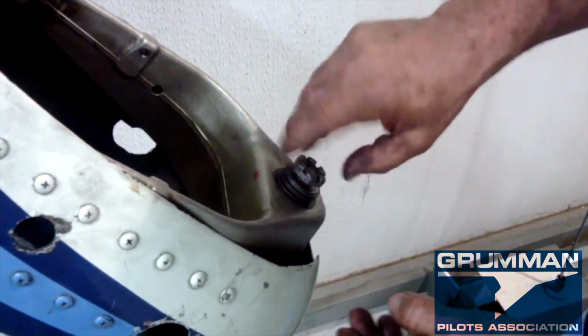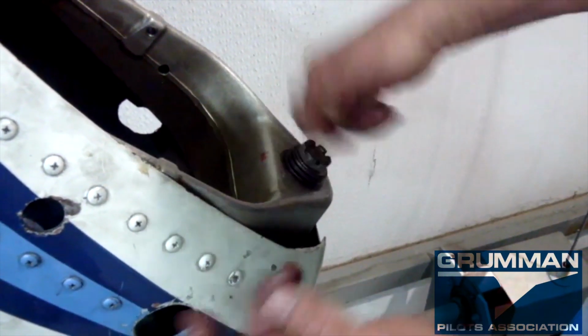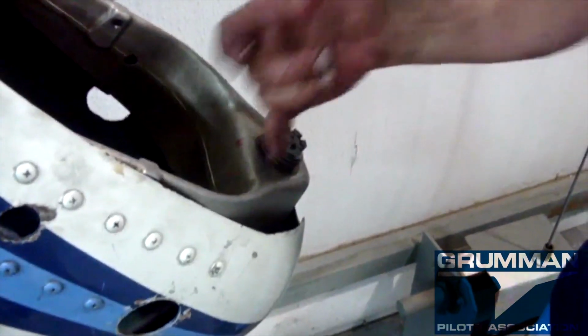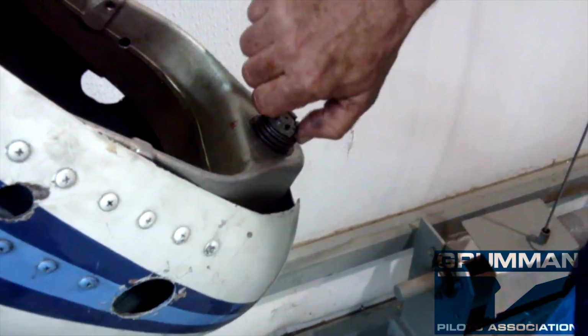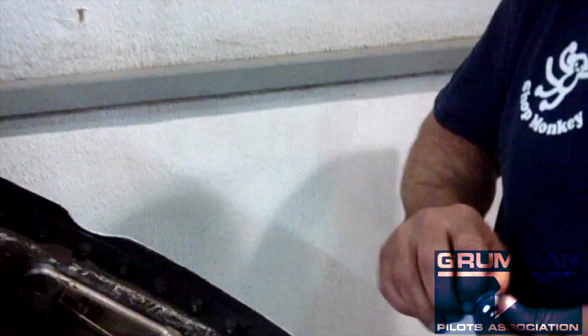The nice thing about having it bolted to the side, as soon as we get the nut down and we reattach the fairing back to everything, then we can pull right here without the tire in here, and we can get our pull test so we know how to set the castle nut and then come back and put the cotter pin in. So stay tuned.